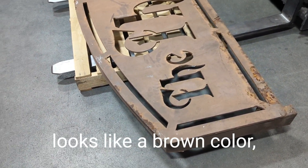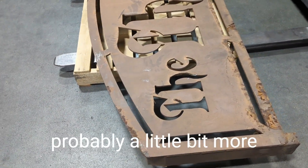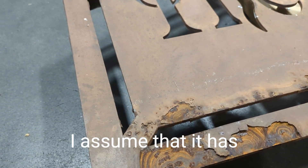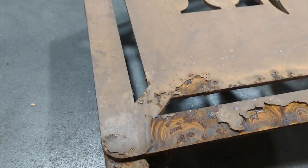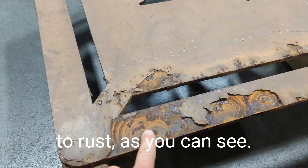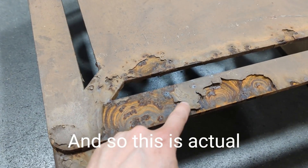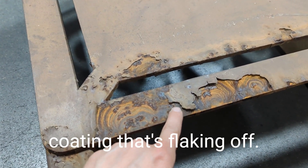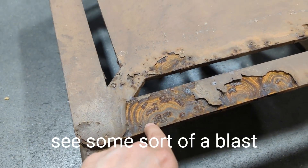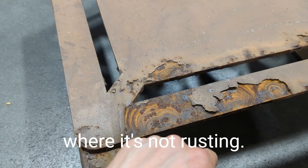Here's the sign. It was originally just a brown color — probably a little more brown than it appears right now. I assume it has faded quite a bit. The main thing is the steel substrate underneath is starting to rust, as you can see, and this is actual coating that's flaking off. It doesn't look like it was originally blasted to me, because otherwise you'd see some sort of a blast profile — it's pretty smooth where it's not rusting.